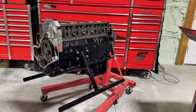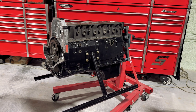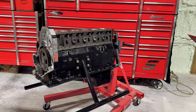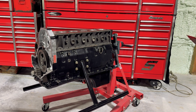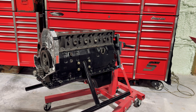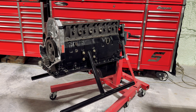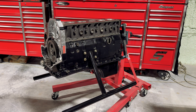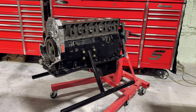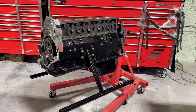Here we have the finished stands bolted onto the engine. You just use the OEM engine mounting bolts and it goes on either side, supporting it centrally. The red stand I was using before isn't ideal for putting cylinder heads on these big heavy diesel engines — it's only pulling from the back, not an even distribution of weight. So I'll lift the engine with the hoist, take that red stand off, and lower it down onto these skids so the weight is supported equally from the centre. It's a lot stronger. If I need to move them around the shop I lower them onto a pallet, and for long-term storage they just sit on the skids on the floor.